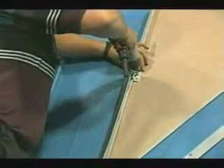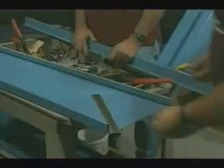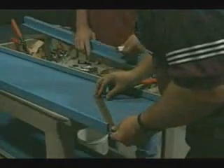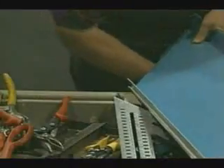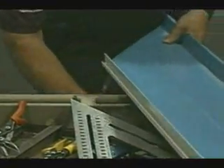The next panel is installed in the same manner. The use of a speed square aids in the ability to find the proper angle without spending too much time doing it. You can now take the angle and transfer it onto the panel. Be sure you allow one inch additional length for the panel fold over, which allows it to be locked into the joggle cleat.